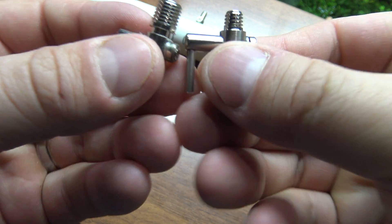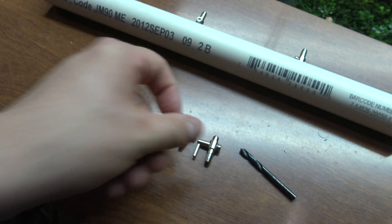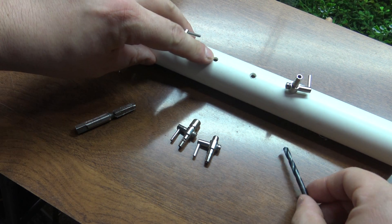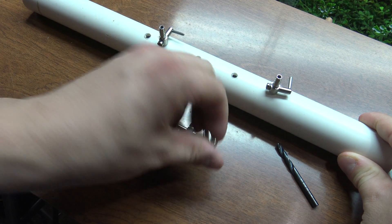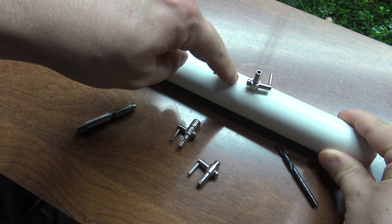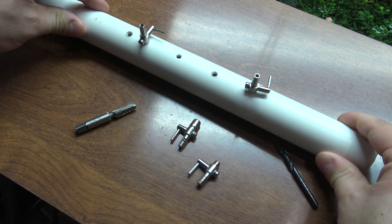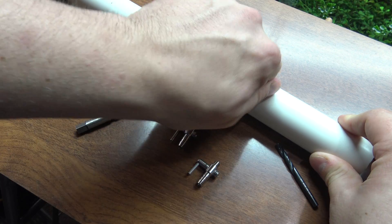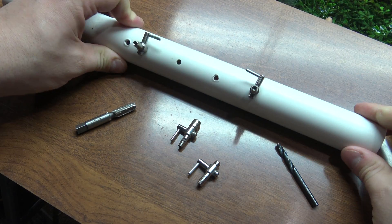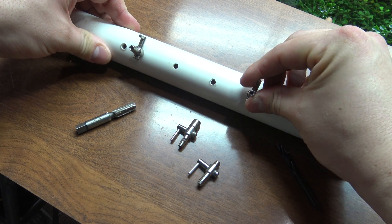You can see, if we compare the two, the threads are quite a bit bigger and they have a little more bite to them. So as long as you're using the right drill bit — in this case it's a number 14 drill bit — you can pre-drill your hole, and then immediately all you need to do is put one of these self-tapping air valves in the chuck of your drill, apply pressure straight down, and drill at a very low speed, very straight, into that hole until you have it basically almost bottomed out. After that, you can just hand-adjust these with a wrench or pliers or whatever you have on hand — you can even do them with your hands — to get them all to line up in a row for your air system or water system.